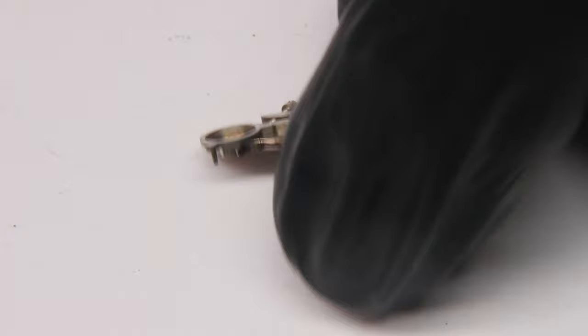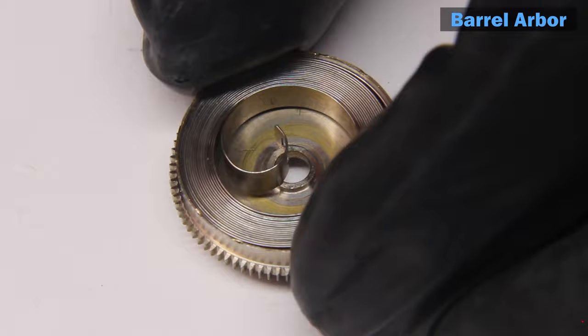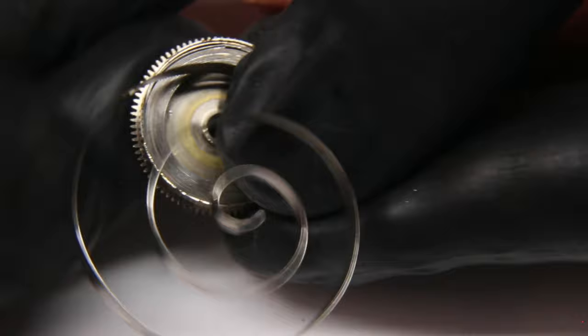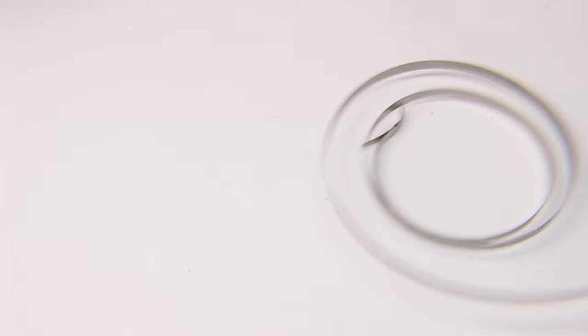This pocket watch is relatively young compared to many of the others I've repaired. As of 1951, which is the year this one was produced, many manufacturers began using a more robust mainspring made from an alloy. Modern white alloy, unbreakable mainsprings rarely need replacing, but watches from the early 20th century have carbon steel mainsprings which are very prone to breaking and can appear tired or set after many years.